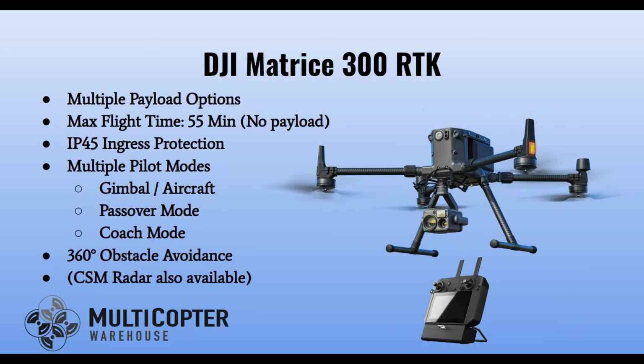Now going over to the Matrice 300, this one does not include a payload, and you would be purchasing those separately, but you can do an assortment of payloads. So it is compatible with the Zenmuse H20 series, the Zenmuse P1, L1, the XT2, the Z30, and the FLIR TZ20R is another one that we carry for this aircraft. Now this one will have a max flight time around 55 minutes. That's going to be with no payload. With a single payload, we're looking around 40 to 45 minutes, depending on the weight of that payload.